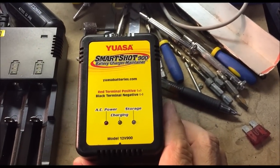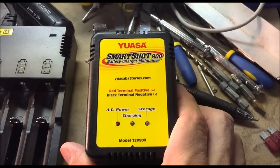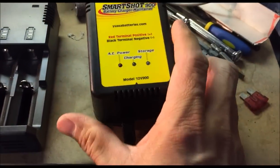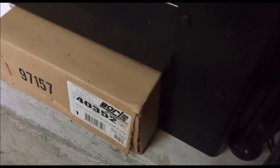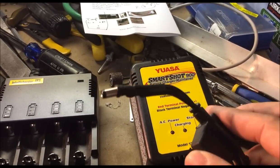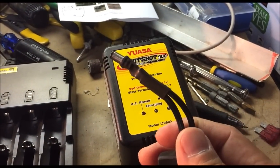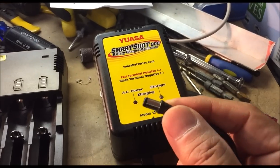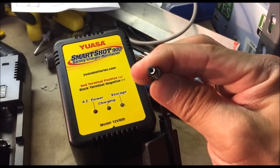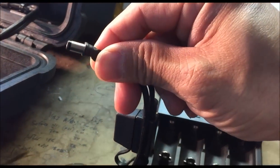This other 900-milliamp 12-volt charger is strictly for sealed lead acid batteries. You can use it on your car — it's great for float charging in winter or as an overnight charger when a little low. What I did was cut off the original clamps at the end, plug it into the wall, use a meter to find out which of the two conductors is positive and which is negative, then wire on a 2.1mm by 5.5mm male DC jack — making sure negative goes to the outside and positive goes to the center pin. Double-check it with your meter.